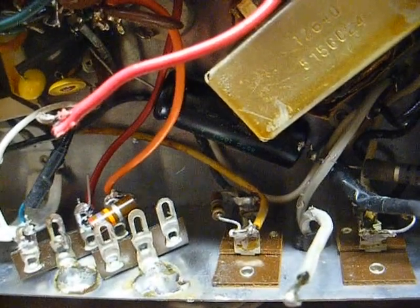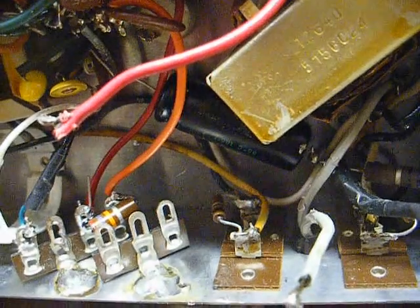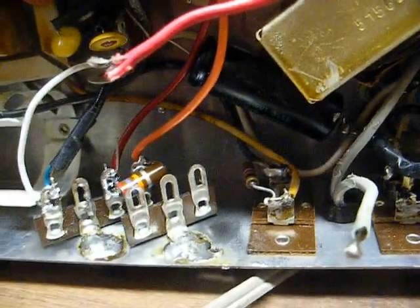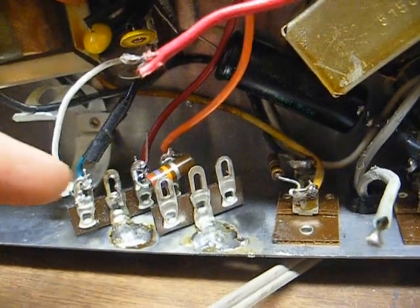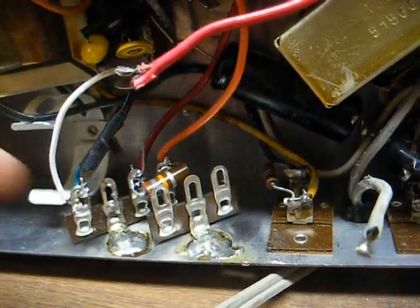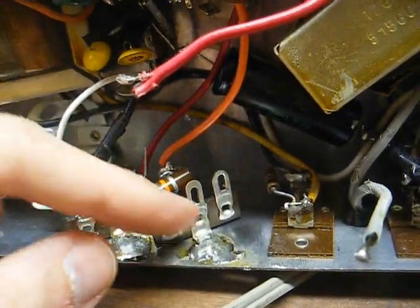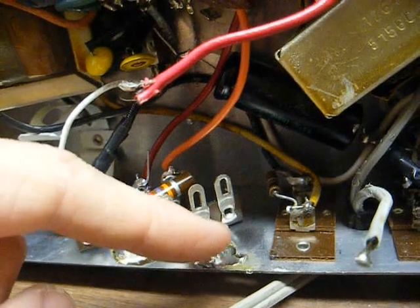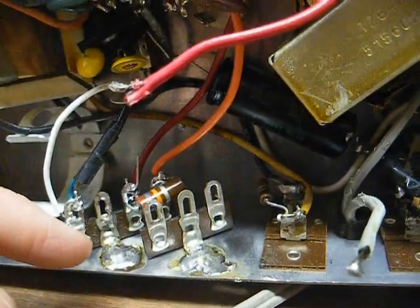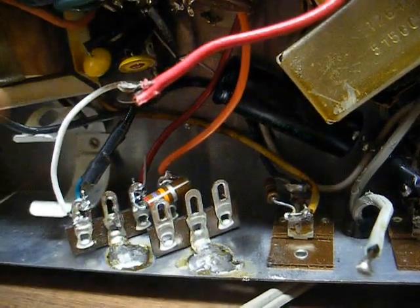If it balls up on the chassis or blobs up, then the chassis is not hot enough and the solder is not flowing correctly, therefore it won't stick correctly. Then you'll want to add a little bit of solder to the lug on the terminal strip to be soldered to the chassis, and then mate the terminal strip lug to the chassis where you've already flowed some solder, and then heat both the lug and the solder and the chassis up with your soldering gun.